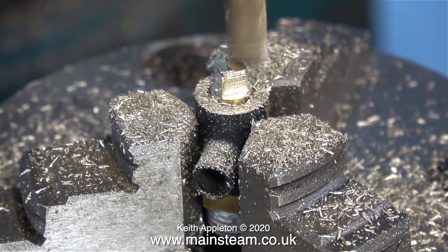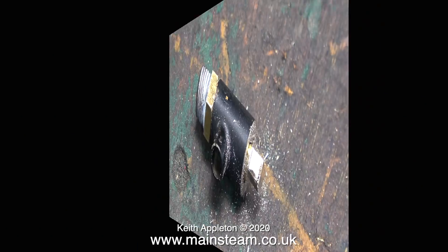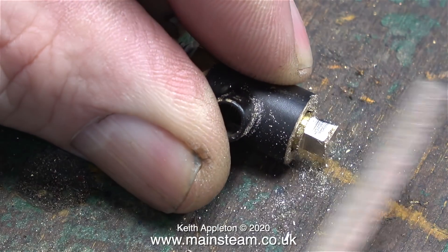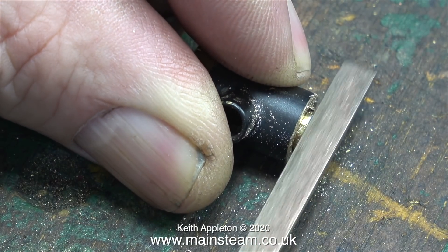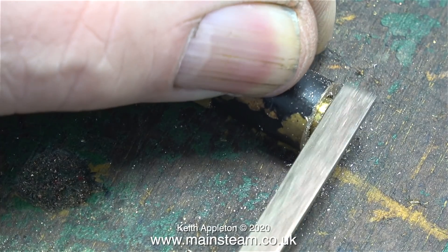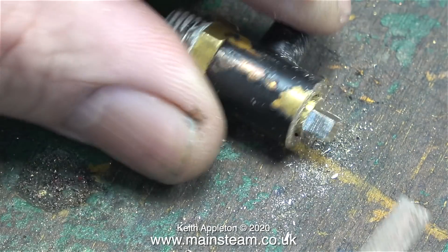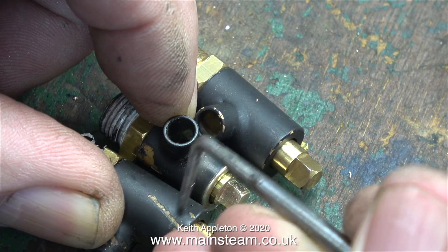In this clip I'm shortening the top of the piece of brass. I haven't rotated the table — I'm just moving the position using the main handwheels on the milling machine, because it's quicker. I'm now starting the cleanup of the milled end using a needle file. Even though the centre shaft inside the valve was very tight, the shaft itself could move slightly so I ended up with some chatter marks on it. But as you can clearly see, it's very easy to remove the marks using this small needle file. That's one valve done — this clip shows the modified valve against a brand new one, and as you can see it's a lot shorter. This will not foul the coupling rod.